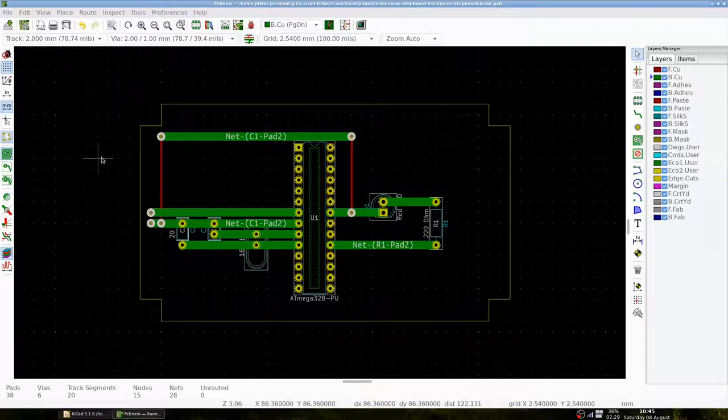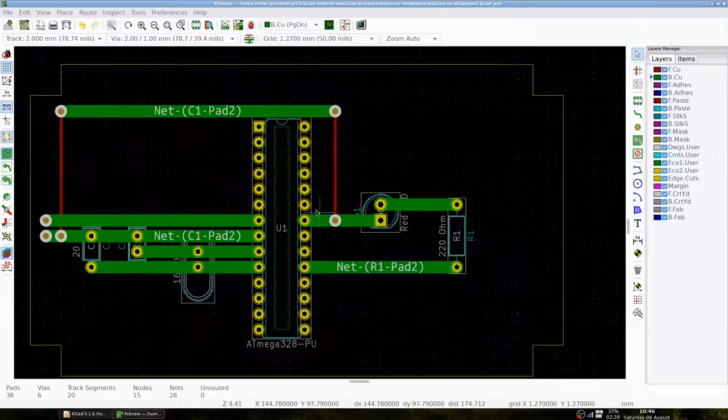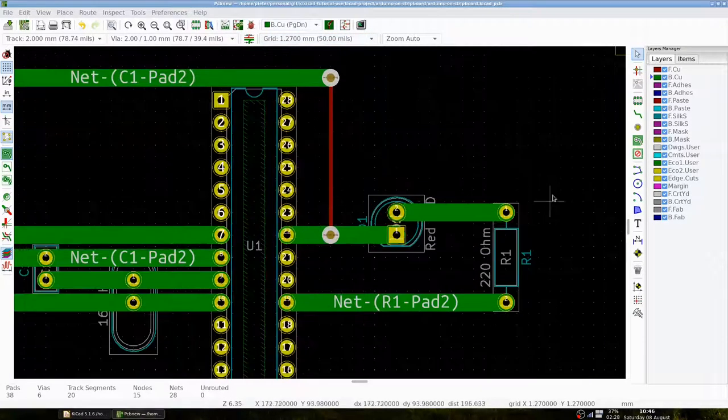We are almost done, but since the strips are present by default on a strip board, we need to verify whether unwanted horizontal connections exist. If we look carefully, we can see that pin 23 is connected to the anode of the LED. Let's add a keep-out area there. We can change the grid temporarily to create a keep-out area for this strip. In the physical world, the connections between the strips in the keep-out areas need to be broken, often done by drilling.